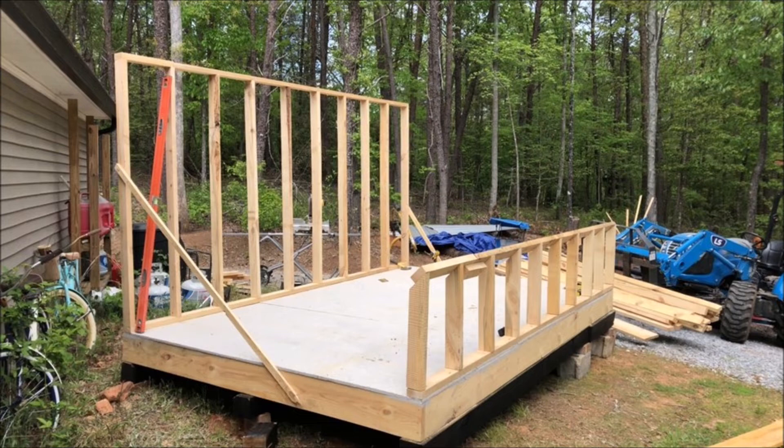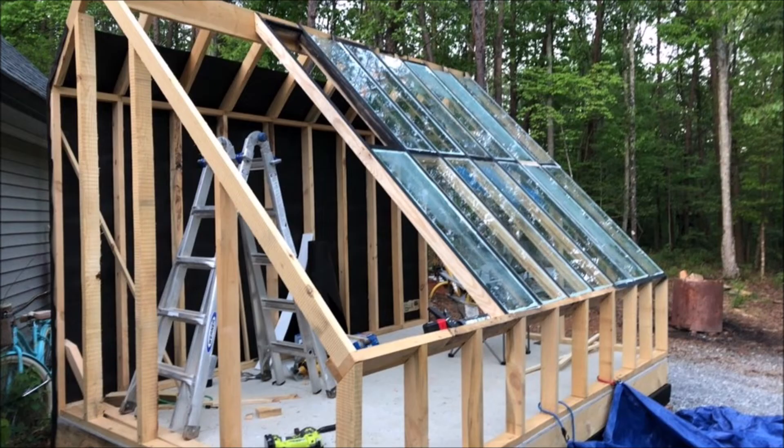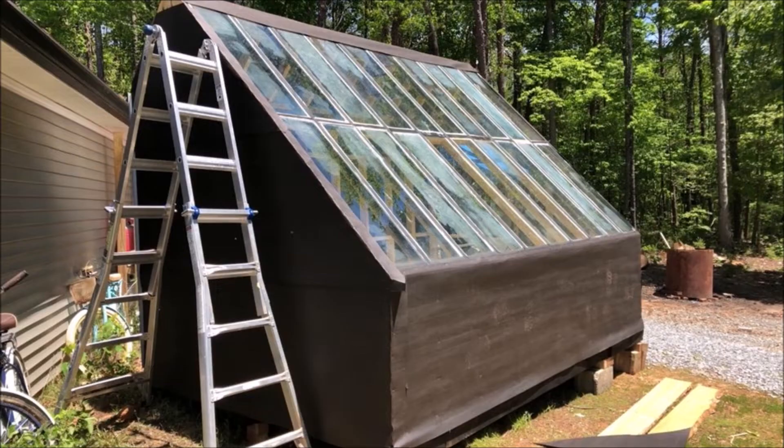By this time, the pandemic was in full swing and lumber prices were through the roof. While most of the mill was sawn on site, I did have to use some store-bought materials. I had six sheets of chipboard left over from another project, so I doubled up for strength. I plan on replacing this at some point but it's held up remarkably well, probably because the weight of the wood is spread out and stickered. I got about 50 glass panes from our free site on Facebook. The plastic roofing that most plans call for would have added about $200 to my cost. I elected to build the roof with these panes, which required a fair amount of work to cut out rabbets and caulk all the joints. With 20 panes of glass and 80 rabbets, there were a few leaks. At the end of the day, I gave up trying to fix them and just laid out UV-rated plastic on top. This has worked out pretty well.